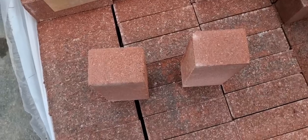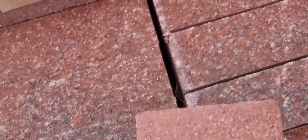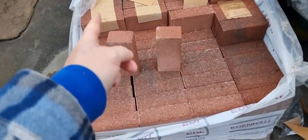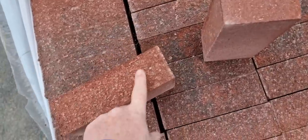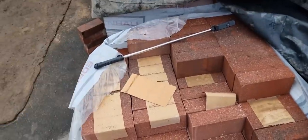We're using concrete bricks. That's what the client wanted, because they match the house there, look. So they're pretty much the same as that. This row on the edge of the brick, just one row, comes as what we call headers. They've got the same texture as the face of the brick on the head of the brick, but only on this one row here.